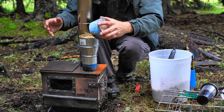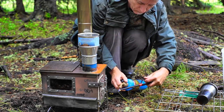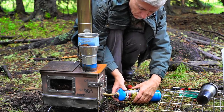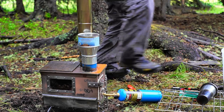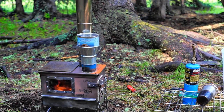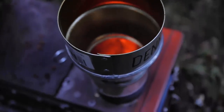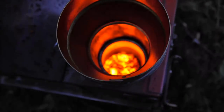In its present state, the hopper takes 50 ounces or six and a quarter cups of hardwood pellets, which is roughly two pounds four ounces by weight, and it takes two hours before you need to reload the pellets again. As mentioned before, using this stove for heating will take a lot of careful testing before I'm even comfortable sharing the details, so please do not put yourself in danger by trying this indoors — always put safety first.